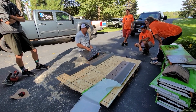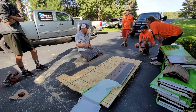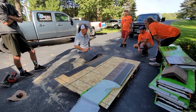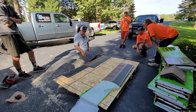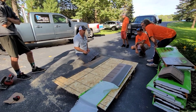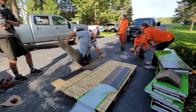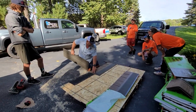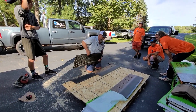The biggest problem about this shingle is going to be this in the next 2 days that you install it. Your air compressor: turn your air compressor as high as you can go, okay? The more guns you put on it, the less air, right? And then what will happen is this nail zone is very, very rigid. I want you to push those nails all the way down through. You're going to do 6 nails in this nail zone. It shows you there's little X's right here. 1, 2, 3, 4. The other 2 are going to go anywhere next to one of these keyways, okay?